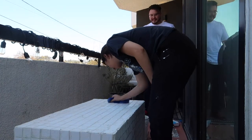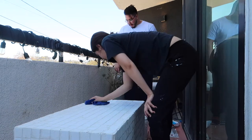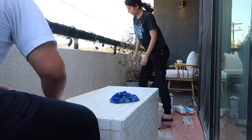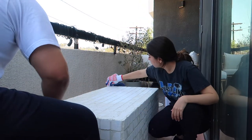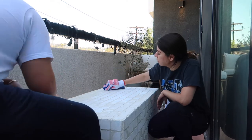At this point you're almost done. Now using a sponge — I highly recommend a sponge over a fiber towel — polish out any excess grout in a circular motion to get rid of all the excess without going into the ridges and removing the bonding that it needs.